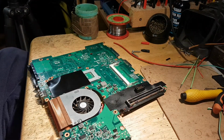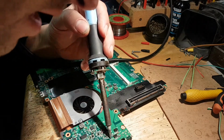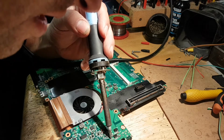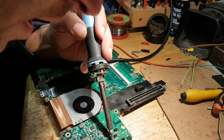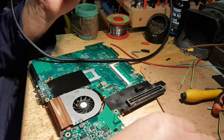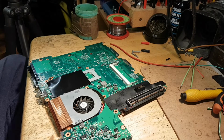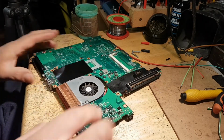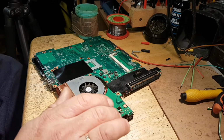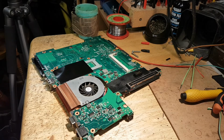If it's the MOSFET. If not, to be honest with you, as I was saying, the MOSFETs are not 100% necessary. Plus, we have all the other ones working. If I can't get this to work with another MOSFET, I might just put the jumper again. So as you've seen, I just removed the wire jumper again. So let me try to look on my motherboards for a MOSFET.